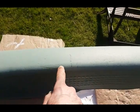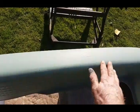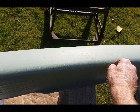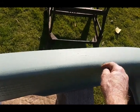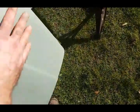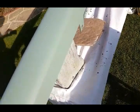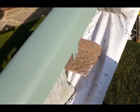There you have it — that didn't take long. It's not a bad finish. There are gouges but it's going to be 100% better than it was. That stuff was super rapid. I'll leave it for about half an hour to an hour in the sun, then give it a light go over with some wet and dry paper — really fine grit — and then I can spray the top coat.